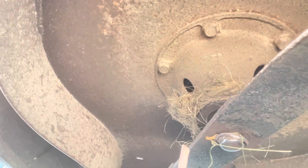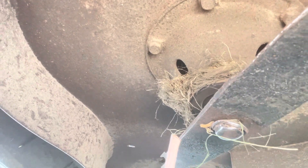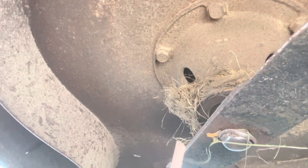I think I may have solved my own problem. Under this blade, which I thought was broke or something, it appears that there's some rope — some type of rope hung up around the top of it. There are actually three blades under this mower. I didn't even realize that. Two of them are clear at the top, and this one on the exact side that's not mowing good has rope tied around the top. So I think it's interfering somehow. Before I panic, I'm going to try to get a utility knife or something and try to cut that out. Then I'll test it and see if it's cutting better.